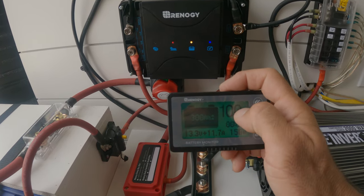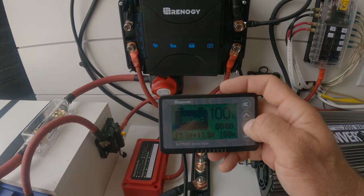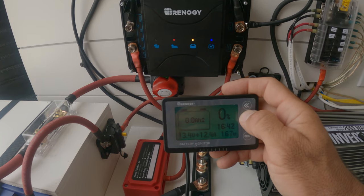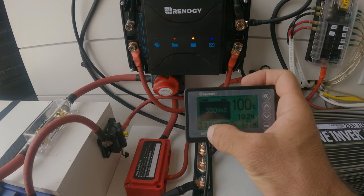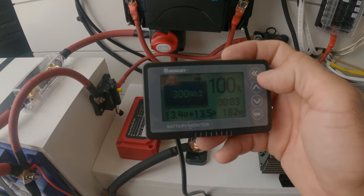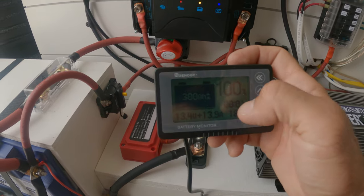You'll notice this is showing 100% — once this reaches full voltage I'll need to recalibrate it and set it at 100. When you first turn this on it's going to show zero percent. You can hold the up arrow button for three seconds and then it'll show 100 percent. We'll need to wait till the voltage reaches 14.2, then recalibrate it again. When you first turn it on, hold the left arrow button for three seconds — that'll bring you into the main menu and you can set how many amp hours you have. I have three batteries that are 100 amp hours so I set it to 300 amp hours. Once charged, we'll reconnect everything.